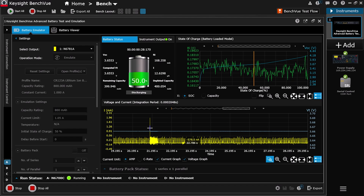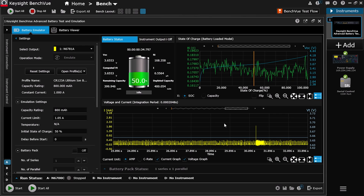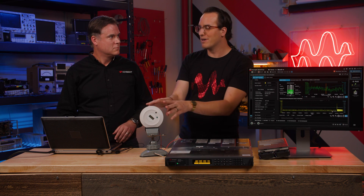Every once in a while it'll connect to the Wi-Fi network. Let me go ahead and hit stop and zoom in a little bit. Here you can see when it connects to the Wi-Fi network, it's almost 2 milliamps. But when it's just taking measurements, it's down in the microamp and nanoamp range — so it's in a sleep state with nanoamp consumption, then up to milliamp consumption when it's pinging Wi-Fi or checking carbon dioxide.